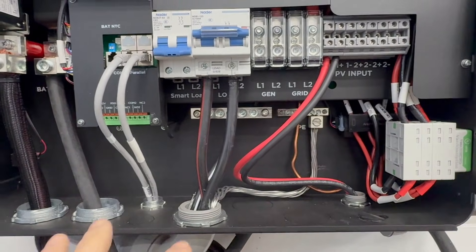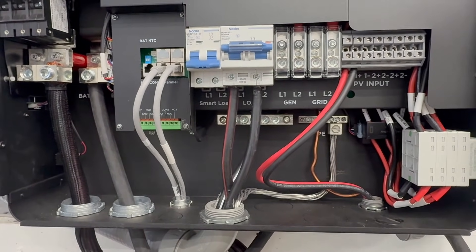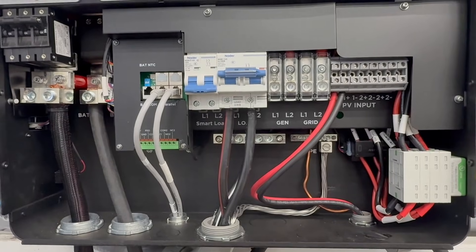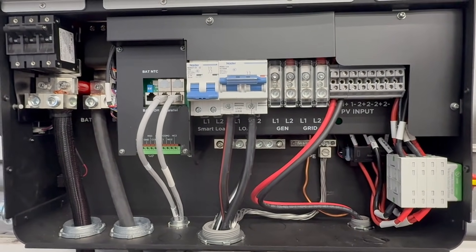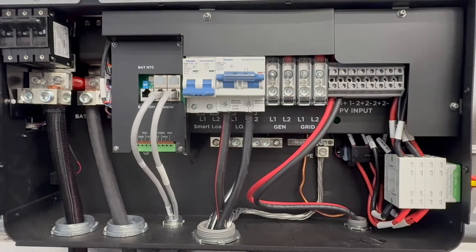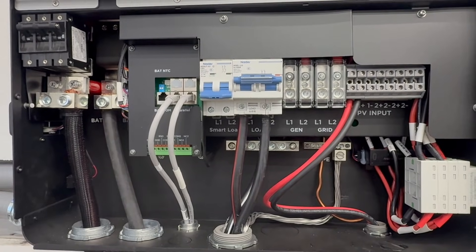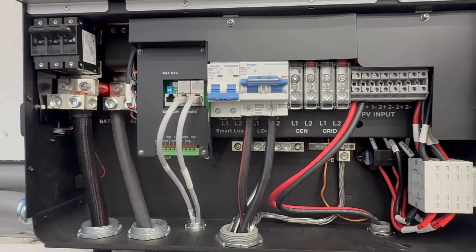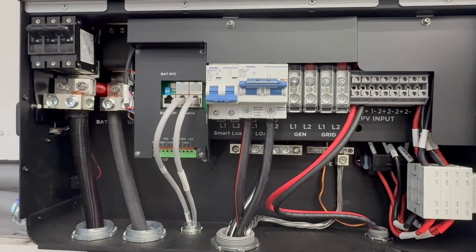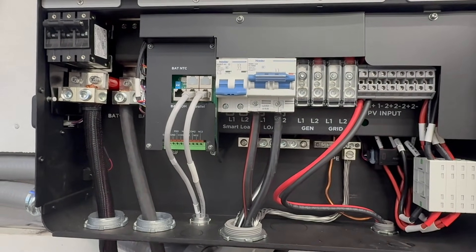However, here's what the asterisk is. Aluminum is a little bit different than copper in a few ways. First is expansion and contraction — it expands with heat quite a bit more than copper does. That means over time, it can potentially loosen up and you can get a bad connection. Aluminum wire used to be very common for wiring up a house, but they moved away from it and went to copper because copper was safer. The aluminum wire has changed over time to make it safer, but there are definitely some downsides and risks.